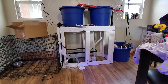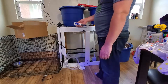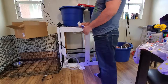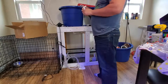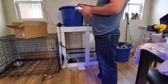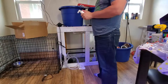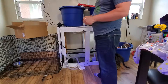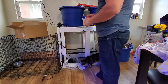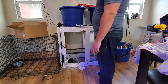I'm going to be building my return line. I'm temporarily using this valve that will go in between the pump and the UV sterilizer. The purpose of this valve is to prevent backflow when I turn off the pump. I'll be switching out for a check valve in the future, but to get this up and running, this will work just fine. Let's get building!